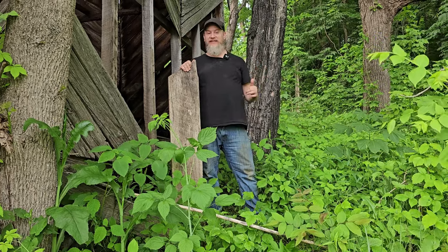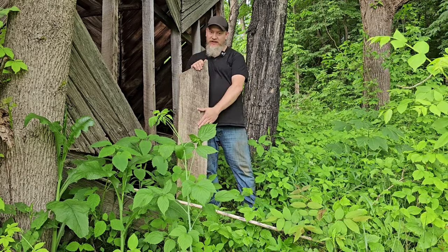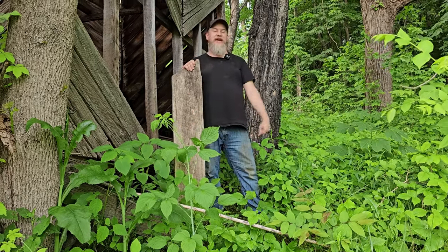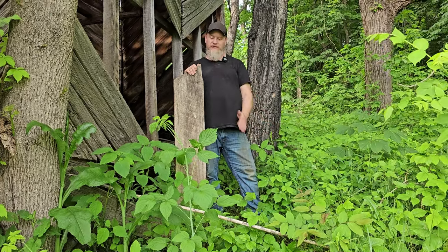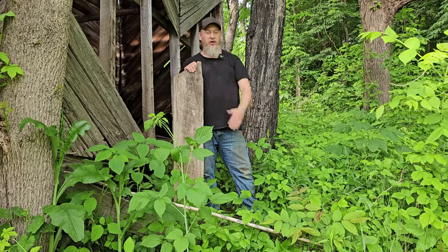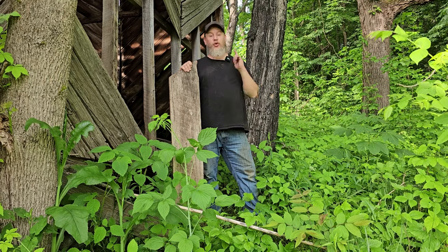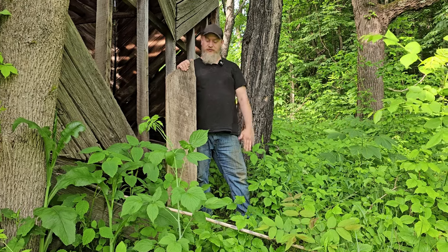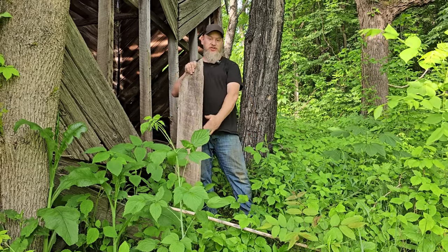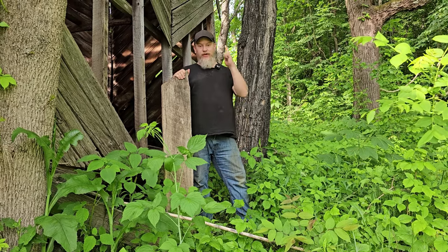One other thing I wanted to mention was that this project was one of the primary reasons for one of my previous projects where I built my router sled. I needed a way to be able to surface these down, despite the fact that I actually do have a planer. The planer just doesn't work very well on big pieces of hardwood like this. So I built myself a router sled to handle the job. And a majority of this project, that is what I use to build the table, from surfacing the boards to edge joining the boards. So I hope you enjoy, and we'll see you in the workshop.